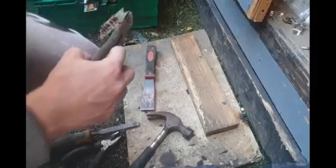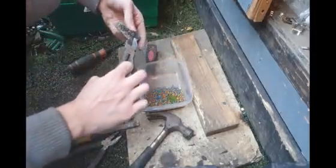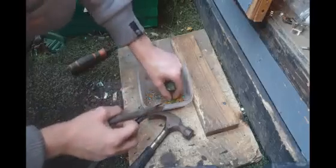These look like old style MLCCs, but they're on like a resistor would be. Let me just break one open and have a look. If you're not sure, break one open and you'll see it's like an actual MLCC inside, which you can't really see. Yeah, you can. It's like an MLCC, so it's an old style MLCC still. I've not seen one like that before, but it's definitely one. So we save it. There's a leaf in here, isn't it?